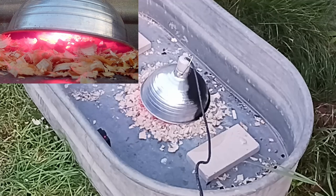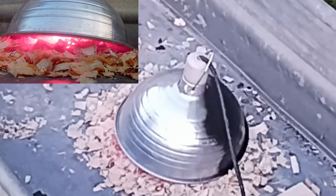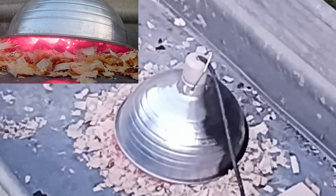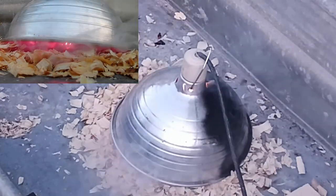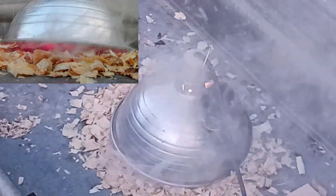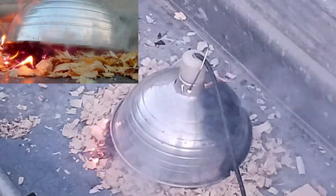Now let's look at what happened with the heat lamp guard removed. What you're watching is time-lapsed over 13 minutes. First thing to notice is that we start to see smoke appearing at about the one minute 12 second mark — a troubling sign suggesting things are getting close to auto-ignition temperature. Then as smoke increases, we see our first flame appear after 3 minutes 10 seconds, and things only get worse from there. It took less than four minutes for things to get crazy — that is scary fast and should be a wake-up call to anyone using a heat lamp.